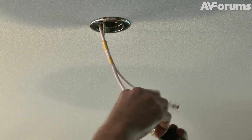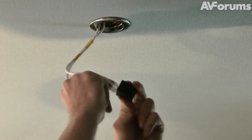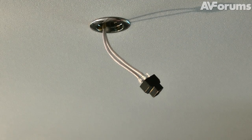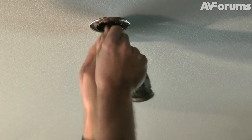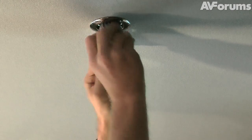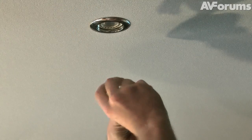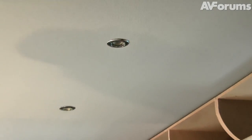It comes with a T-piece connector, so you literally just click the LED into that, and then you daisy chain the LED. So in this case, there's six. There's an RJ45 network cable that goes between each of the LEDs and provides the power. So there's literally just low voltage power going from the power supply. There's no mains cabling. It's something that can be fitted yourself quite easily.